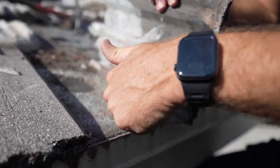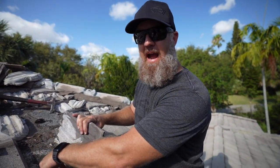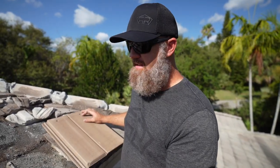The 90 pound will break down in several locations as we go around the roof perimeter. And the water will have then pushed below the underlayment at that cracked seam, rot out the fascia and plywood below.